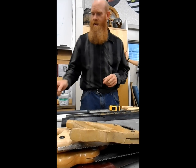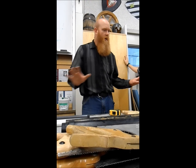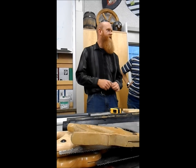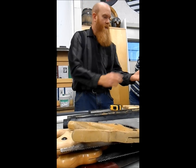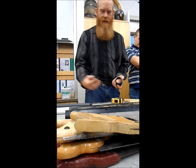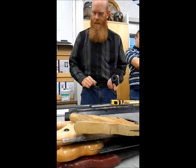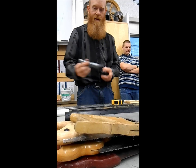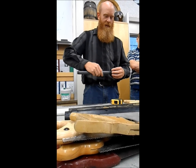Today I already showed you guys just a few little steps of getting pieces together, but we're going to show you most of the steps today to put together this crevice sucker. You already grabbed one of these adapters, two inch to inch and a half, and the insert for it, that's an inch and a half to three quarter inch thread. You've taken the three quarter inch riser, cut it in half, and threaded it in. Those are pretty simple steps.